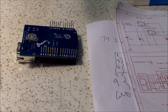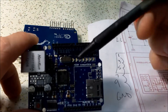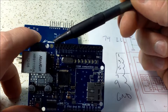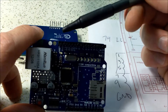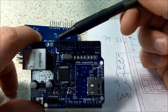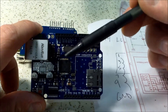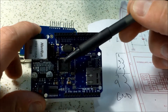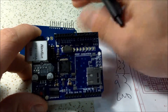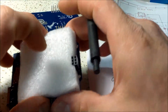Hello everybody, welcome back. Today I want to talk about this Arduino Ethernet Shield. This is not a rev3 board because it does not have the SDA and SCL lines broken out. This is actually what I found to be called a rev5. This board is available on eBay for about seven to nine dollars - really inexpensive. It has the WIZnet W5100 chip, not the PIC clone or the ENC28J60. It has an SD card and it's MEGA compatible because the pins are broken out to the ICSP header.